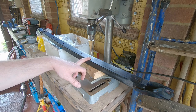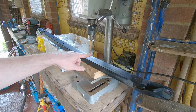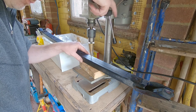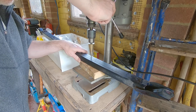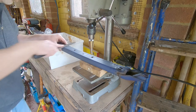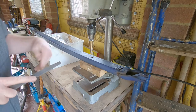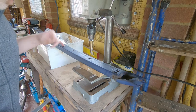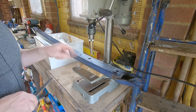The nutserts need a 9mm hole drilled in them, so on this step drill we start off at 4, 6, then 8, and then we'll have to change bit but we'll carry on with this one. Let's quickly deburr the top of them — I can't really get to the underside, I haven't got one of those hook deburrers, and they only really work on the outside anyway. I think we're just going to send it — there might be a small burr in there but it should squash fine anyway.